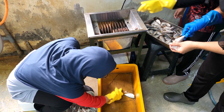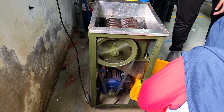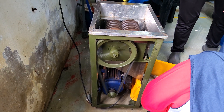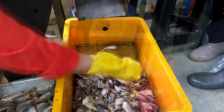Here is another angle of the machine in operation — you can see the motor is now turning and the blades are turning quite fast. You might notice that fish sometimes tend to bounce out instead of going through. This is likely because the blades have become blunt and you will need to sharpen them over time using a grinding disc or cutting disc.